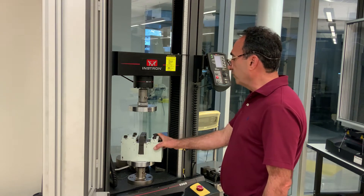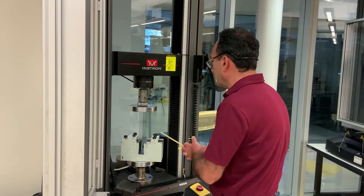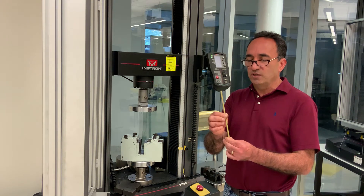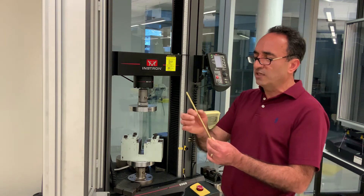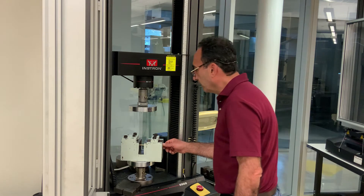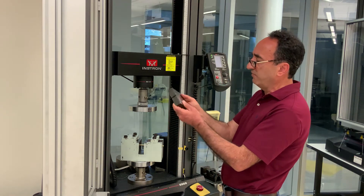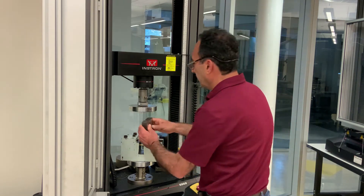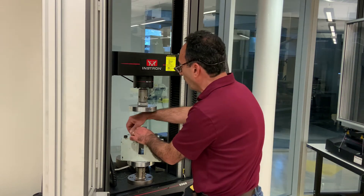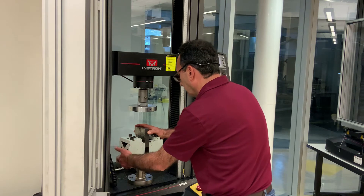Just turn the block if you want to place your specimen. Pick this block and place it here. You see how brittle these materials are. Place your sample underneath. All you need to do is measure the diameter - I would take the diameter at three places and take the average. Since this is a quarter of an inch, put it in the quarter-inch part - this block handles half inch, one inch, and quarter inch. Then tighten it up, but don't make it too tight, otherwise when the material shears off it's tough to get it off. Make it symmetric and straight.